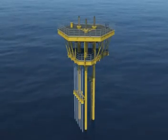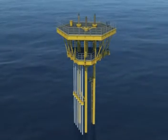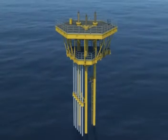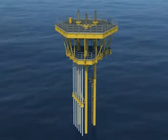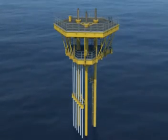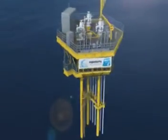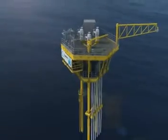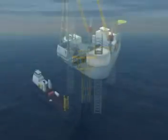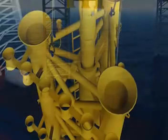The jackup is also used to install the export risers and I-tubes. A speedy process which requires no special handling equipment. Each one is fitted in approximately 6 hours. When this work has been completed, the rig is released to continue drilling the wells through the conductors via the topside section. Installing a C-Swift platform is fast. From the arrival of the subsea structure on site to handover for drilling, a typical four-slot platform takes just 4 rig days to install. A speedy, low-cost means of reaching oil and gas reserves in shallow waters around the world.